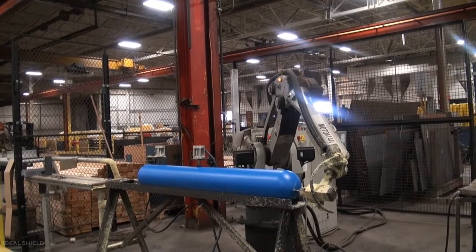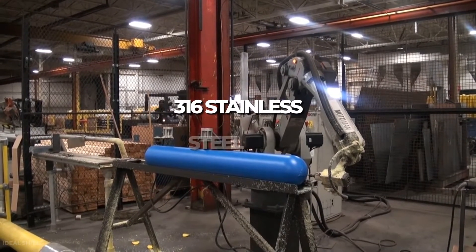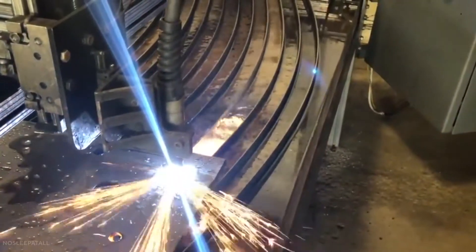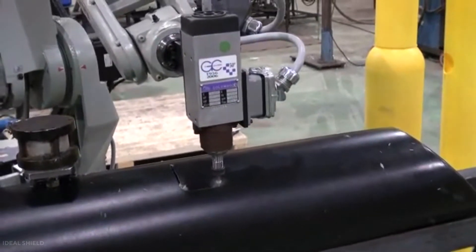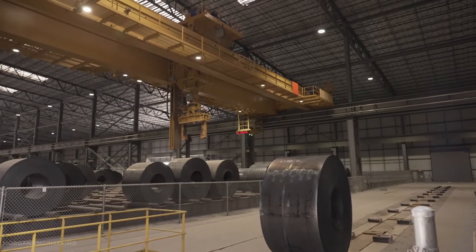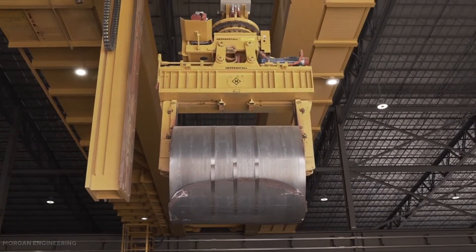The procedure begins with a high-quality grade 316 stainless steel pipe. Grade 316 is more durable and versatile than its competitors. The inclusion of metals such as chromium, nickel, and molybdenum in the alloy results in better resistance to corrosives such as acids, alkalis, and chlorides. Not only is stainless steel chosen for its properties, but it is also a valuable decorative material for enhancing modern architecture.